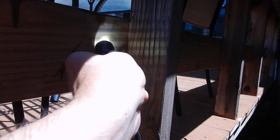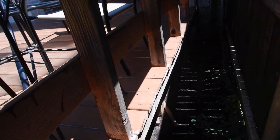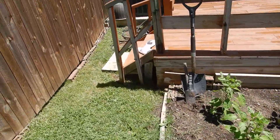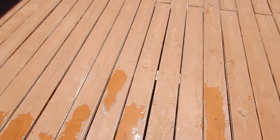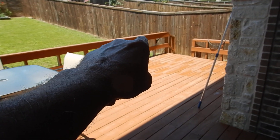Parts of this deck have not been stained, and other parts of this deck have been painted. It appears to be paint. The problem with paint is it doesn't let the deck breathe. Because this is a cellulose material, it doesn't let the deck dry out like it would. We've got some pretty good gaps, but the paint prohibits it from drying. This should have been stained — over there where you don't have any stain, that should have been stained too.